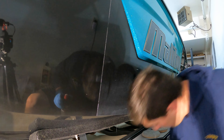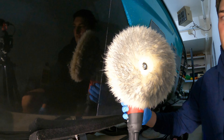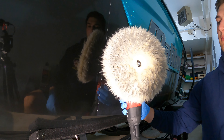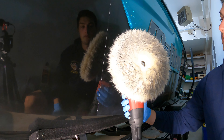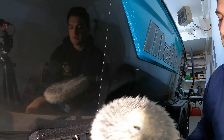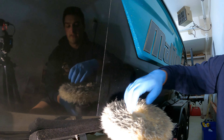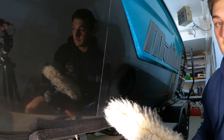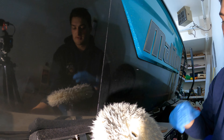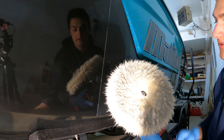The first thing we're going to do is take our rotary. As you can see, what looks like dirt on here is actually the gel coat coming off a little bit because we're running the rotary. What you want to make sure you do — what I like to use — is an air compressor, just to make sure the wool pad is always fluffed up if it gets matted down. This is a double-sided wool pad, so that gives you a little extra working time because you can just flip it around.